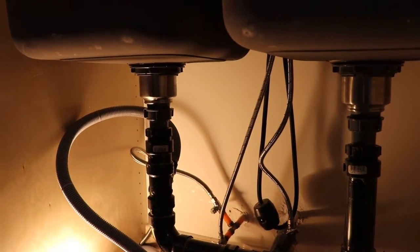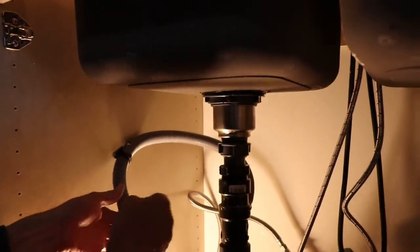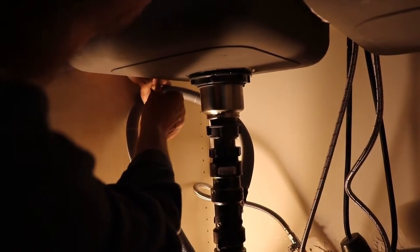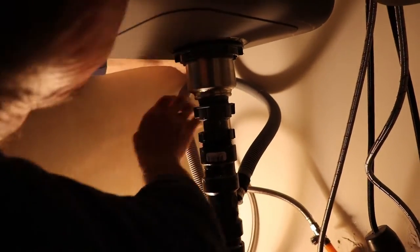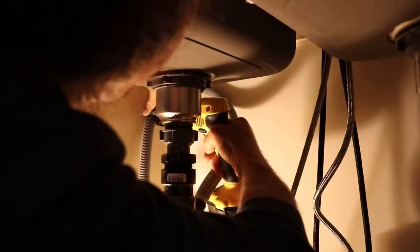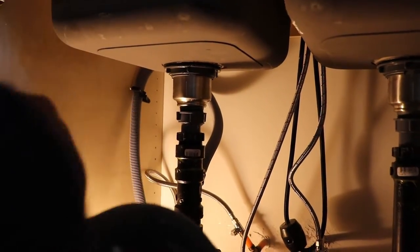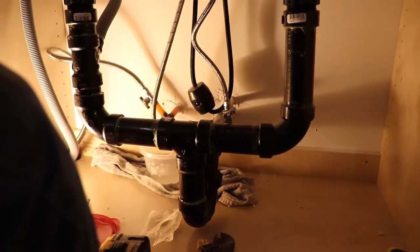Let me see what I have in stock. I found this clamp here that is for three-quarter pipe — I'm just gonna use two of them. Because they're not the exact right size, I'll put one on each side of the pipe so it will go nowhere. I'm going to find a place where I have access to screw it — not right here, so it gives more space to put stuff under the sink. I just open the water and I don't see any leak. That part is done. We have the drain connected and we have the water connected.